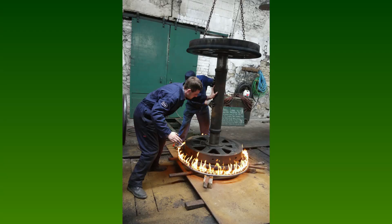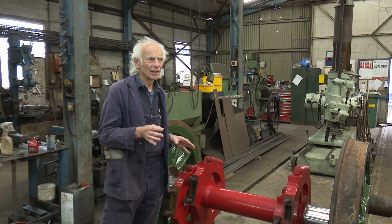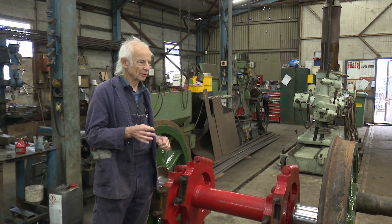We do all this work in-house. Here we are fitting new tires to the locomotive. It works by getting a tire up to a certain temperature so it's actually only about 30 thousandths of an inch bigger than the wheel, and then we gently drop the wheel in and allow it to shrink on. There's very little we have to go outside to do on repairing a locomotive.